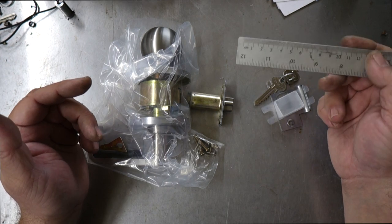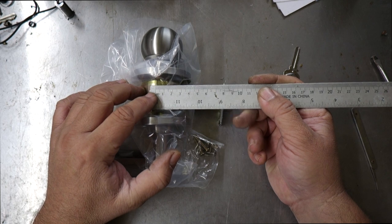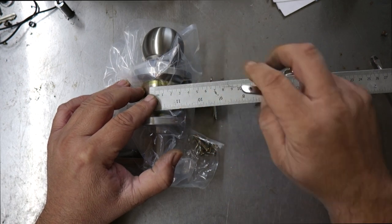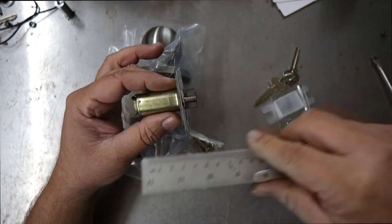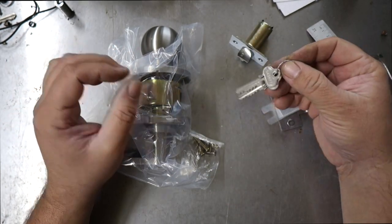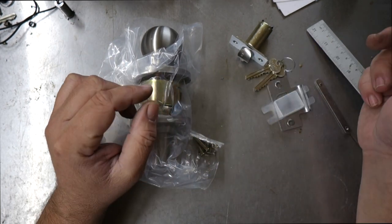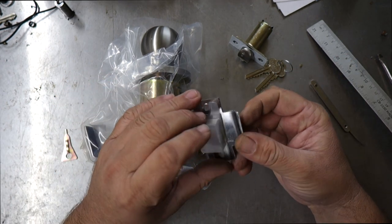You've got three options: 60mm, 70mm, and 127mm — measured from the center of the lock to the edge of the latch, which would be the edge of the door. That's a fire-rated latch as well, so you could use it on a fire-rated door. The keys — two of them — are branded Brava; the code is on the back and typically represents the actual pin positions, so you could order a key to code.